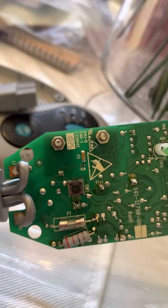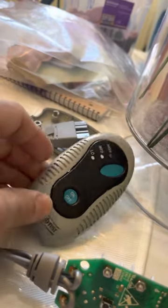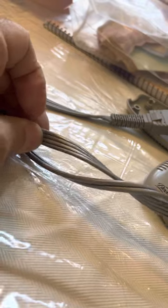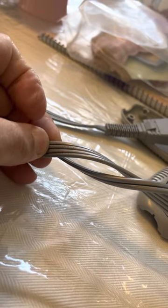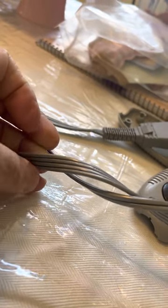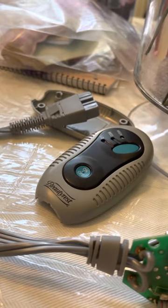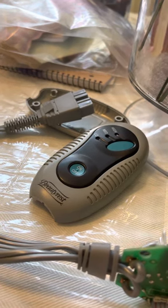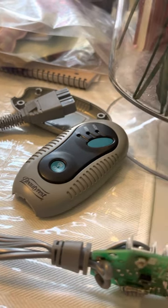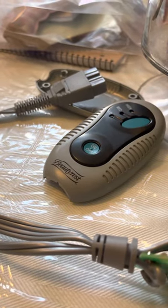I hope this gives you an idea of how this works and maybe there is an easy fix — if it's just a crack or break in the wire, you can open it up, attach it, solder it, and insulate it again. But usually electric blankets are known to break down easily if they get abused or used a lot, and usually after about a 10-year period the components go bad. Thanks for watching and stay safe.